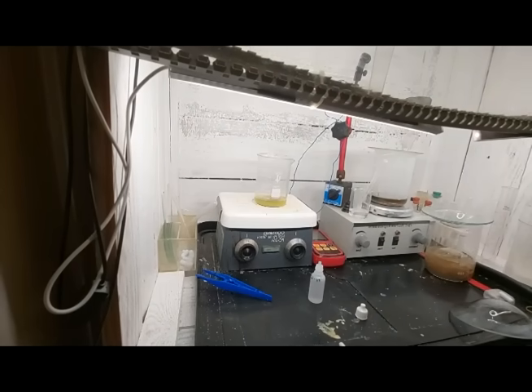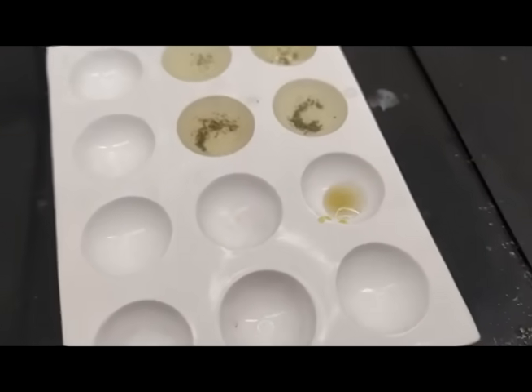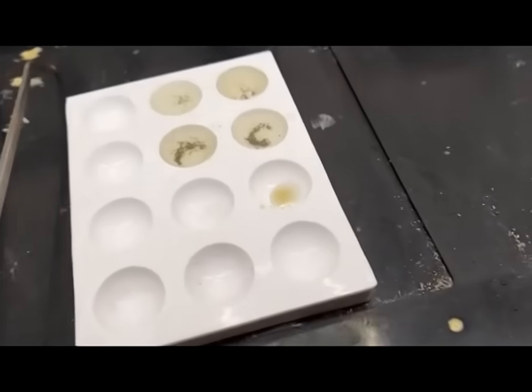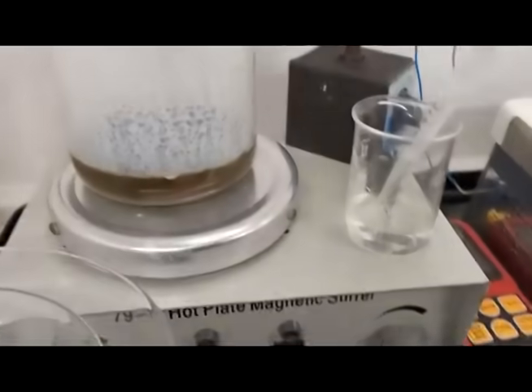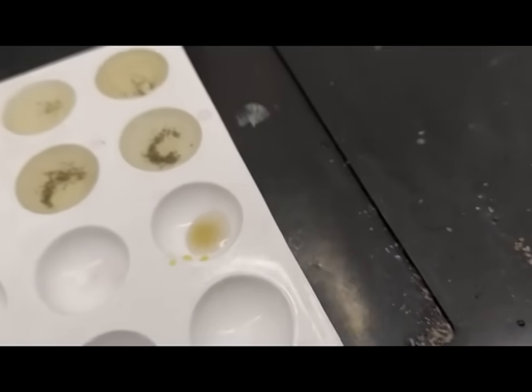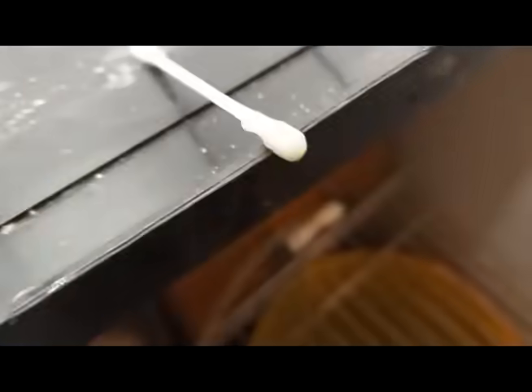We tried to get a good clean sample but it was almost impossible. I don't know if it's showing up on camera but there's a little purple on the side of the yellow stuff. It also turned a little blue. Both the first and second samples are negative for precious metals in solution, but this sample that we cooked in hydrochloric for a while then added nitric — which reacted violently — this material right on the edges around that yolk-looking yellow stuff in the middle is a little purple.